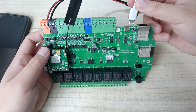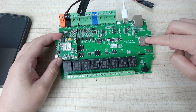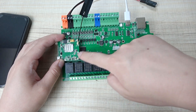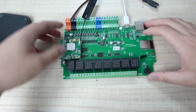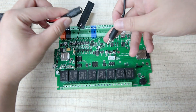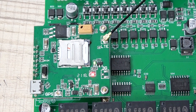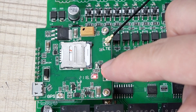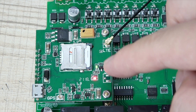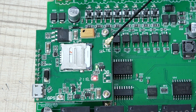I will use this Type-C cable. Before testing, we will download the Arduino code to the ESP32 module. That will let this module and the Type-C serial port communicate directly. Now I can power on this board. Let's look at the computer. When you power on, wait for a moment — the green LED will blink, which means the SIM card is successfully registered with your internet service. So that will work fine. Then prepare to test the software.